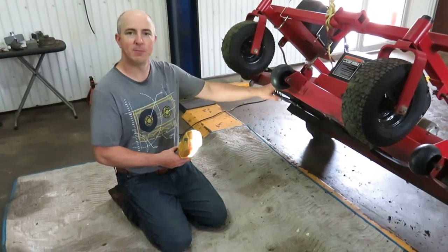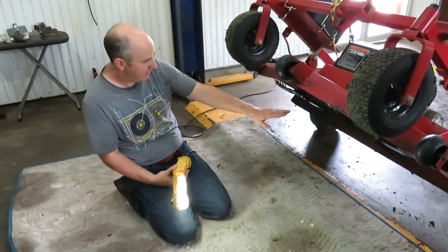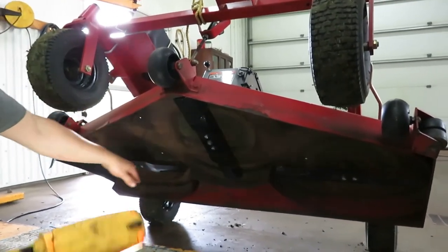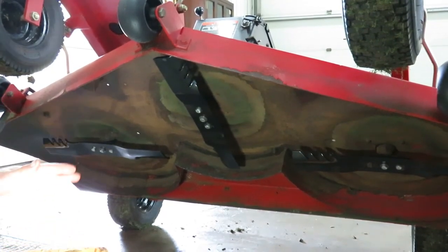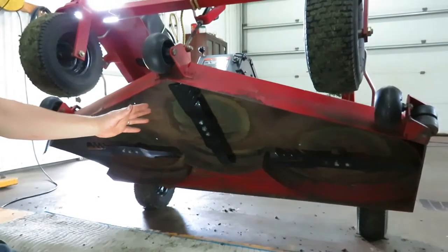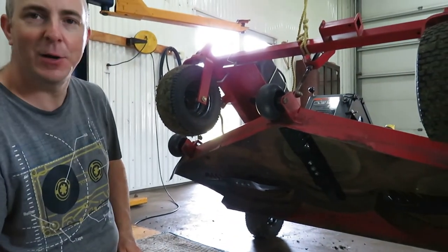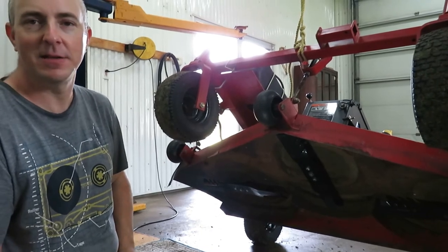The three blades are installed and all nuts and bolts are tightened down. I don't have torque specs, but just use common sense. I want to give a quick tip about blade positioning: keep the center blade in line with the deck and position the two outer blades 90 degrees from the center blade. This creates the most optimum condition — it allows grass to exit the deck in the most efficient and quickest way possible. I would set things up like this if you decide to undertake such a project. Now let's put the deck down, get the belt guards installed, and we'll be done.